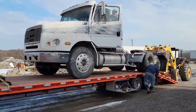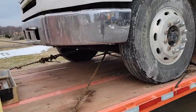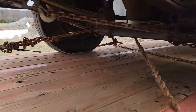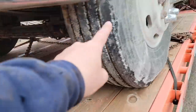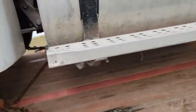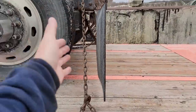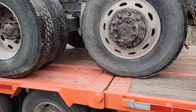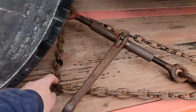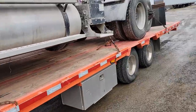That wasn't too bad. Alright, we are loaded. I left the winch on — it's wrapped around the front axle and the outside of these springs. This one is just an extra going around the axle. I've got four corners: two pulling forward, one pulling back, one pulling back, and then this one is kind of pulling back. So I think we're well chained. Tires look good. Truck suspension handles it just fine. We took our extra chain and bungeed it so it's not flapping around looking loose.